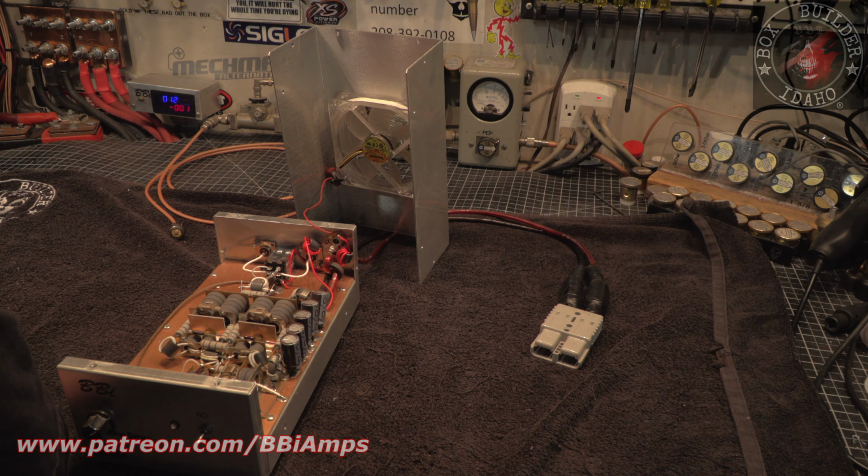I'll ask you about this when you get here, Don, if we want to stay with this size chicken wire or not. I got rid of that 40 picofarad cap that was back here. It was still reading 35.5 picofarad. Changed that out. Changed a couple of the other little things around that I'd like to do. And it's all back to life. Two new Toshibas in it. The other thing is I got rid of that ugly little blue fan on top that didn't move hardly any air. I went with a higher flow fan, which helped keep the box a little bit cooler.